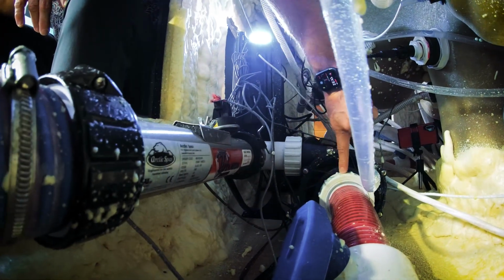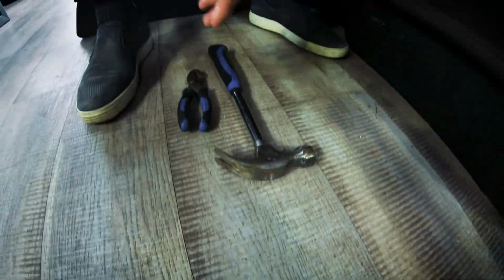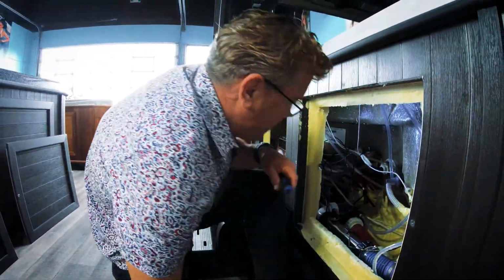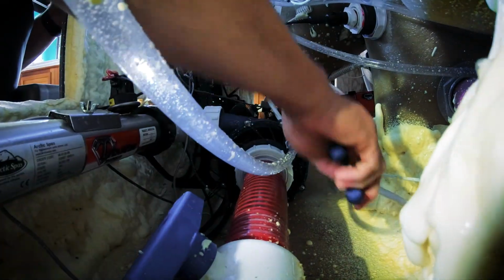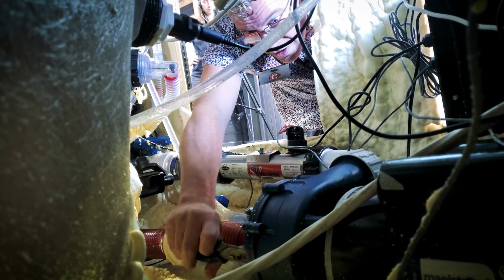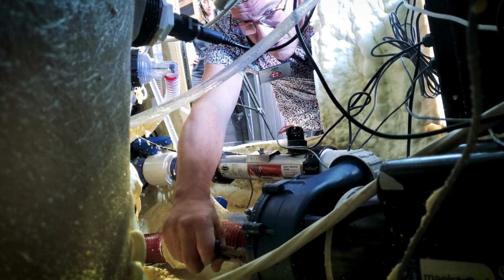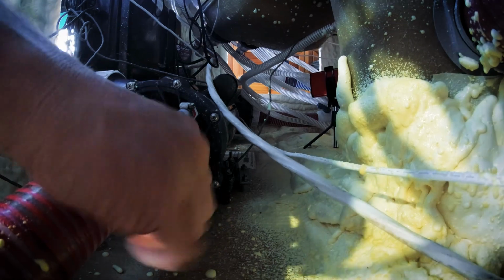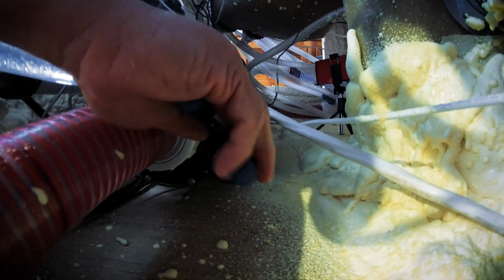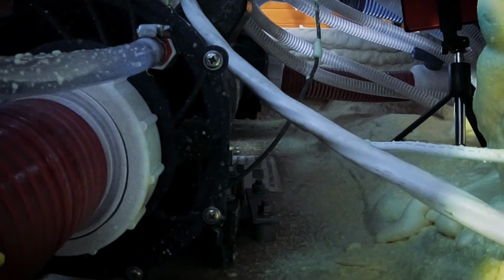And you see how these have got notches on them here? So I'm gonna show you the tool. I could use this, and okay, so I could take my pliers, I can grab on here, and then I can just twist this. You see how it turns? Now this one's actually moving well. So in this case, if I had this and it was moving nice and freely, I could just turn this, and you turn this until water starts coming out of there. Right? And then that makes sure as the water comes out, it's bleeding the air.